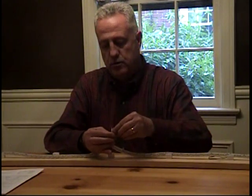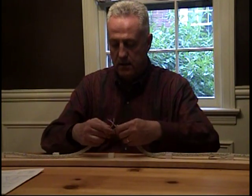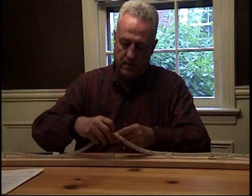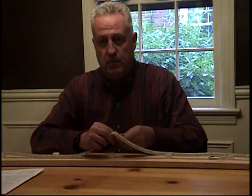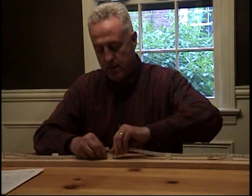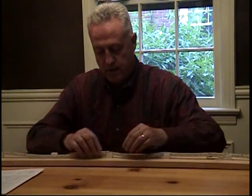Take the other four — the two outside from either side. Now keep in mind when we're doing this, we want this so that it's wired down, so that we're going to end up tucking it underneath. All four wires together, and we put the wire nut on. We bend them underneath each other the same way. Snap this one in first on one side, snap this one in second because you have the wire underneath it, and tuck the wire nuts right underneath it.